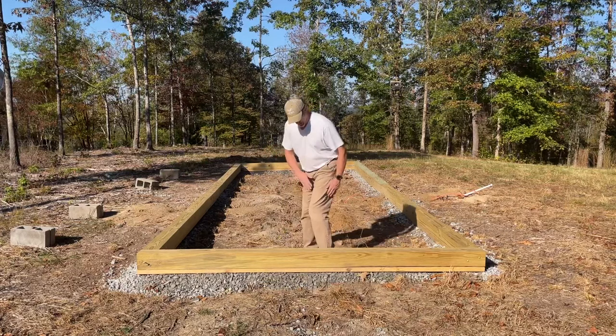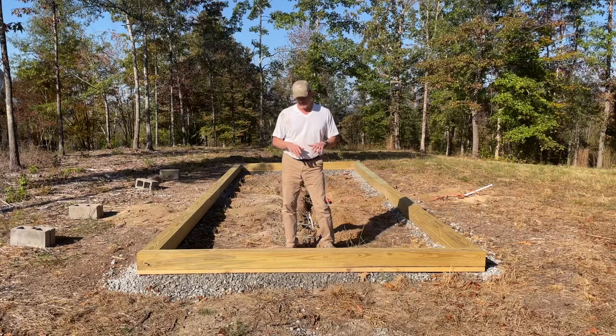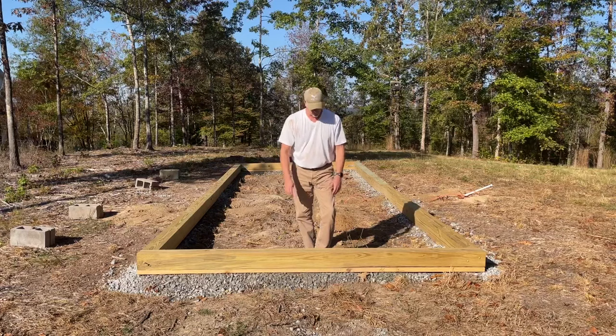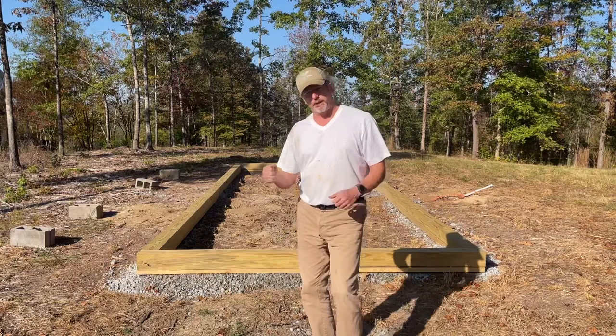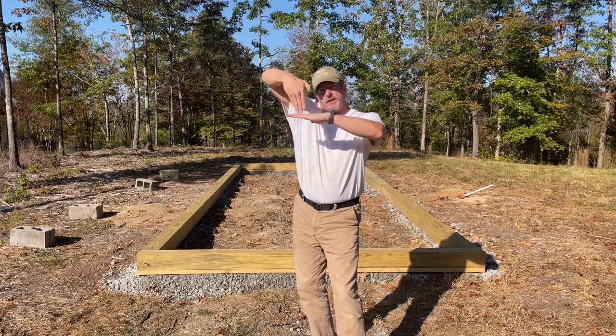This is a good height up — you can see where I'm at now. Now that I've stepped in here, I've got an additional six or eight inches I'm going to be able to work with. That means I'm going to have more height up here, and yes, I'll have to step over — that's not a big deal for me. I'll also build up around the rock to make it more stable. The crush and run: I put it down, tamped it down, then sprayed it with the water hose and let it settle. I went back and leveled it again. You've got your string level, you put your crush and run, you tamp it, then you measure and make sure the height.